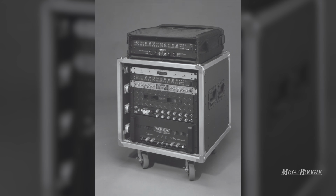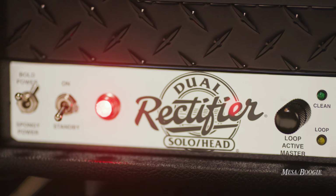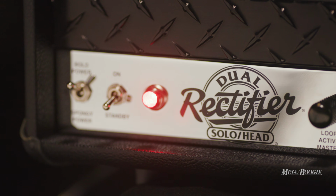It certainly wasn't easy. We had to go back into some older revs. When I say we, John Marshall was huge and instrumental in doing this, going back through each part of the circuit to see what made each thing special, because there's so much inside this amplifier for its time, and even today. What were the best parts of those circuits, and what could we improve upon? And some of the things were through board layout. We've had years of experience laying out boards now since this first one. We know that some things in proximity don't want to be together. There's certain layout tricks that we have that Randy has taught us along the way. When we got to the end of this thing, we realized we had a cleaner, meaner, better rectifier, and there's no denying it.